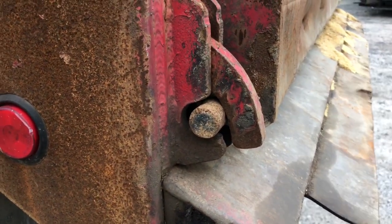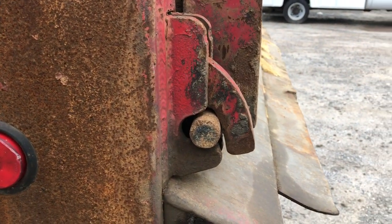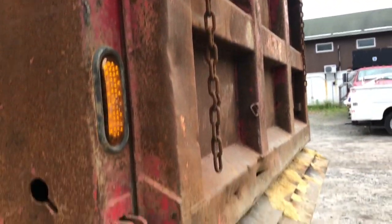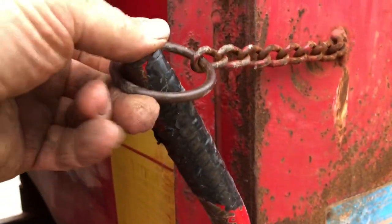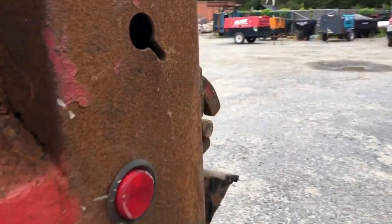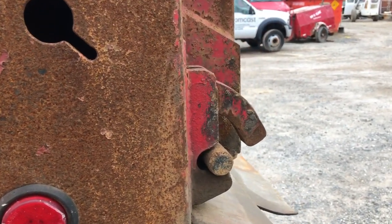This is my next stunt — the tailgate on this dump truck. It's a common problem with a lot of these dump trucks. This finger here is what holds the tailgate closed through a rod, and there's a little bit of adjustment there. This rod goes all the way up to this lever — that's the finger — and then the tailgate swings open from the bottom.